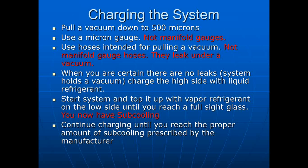If you see bubbles in the sight glass, it typically means you've been called because there's a problem. Moisture liquid indicators are also available — they include a color indicator showing how dry the system is, so you'll know at a glance whether there's a moisture problem.